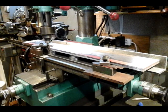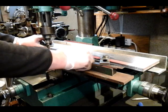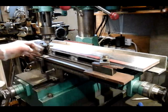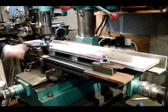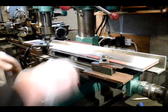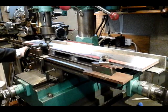When you've only got a small milling machine and small equipment you've just got to make do as best you can — it's not an ideal situation. For any beginners, I'm going to take a couple of roughing cuts to remove the majority of the material, not taking very deep cuts, leaving a little bit on just to touch that face I've already machined and take a finishing cut. Also watch out that you're clamping over your parallels and you've built it up enough so your handles and machine will clear.